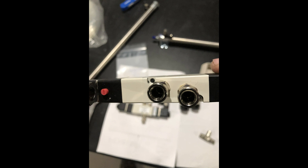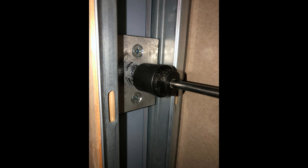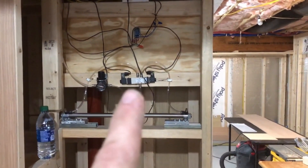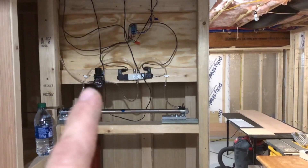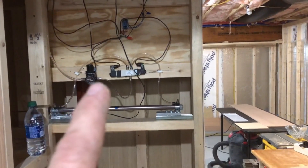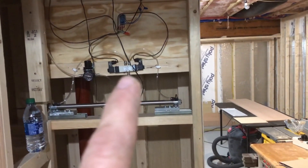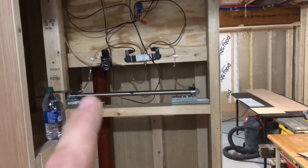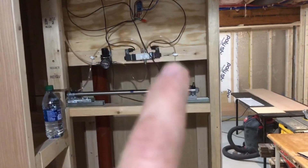That picture shows the top part that connects to the cylinders. There's a little red button — if you push it you can manually control the solenoid valve, and if you push it in and turn it with a small screwdriver you can lock it on. Here is my full setup: I have the cylinder with the solenoid valve and a regulator set to 50 PSI. The incoming hose goes to the bottom side of the solenoid, and each line out the top either opens or closes — one goes to each side of the cylinder.